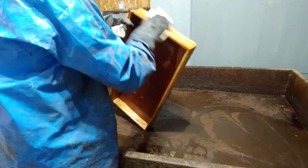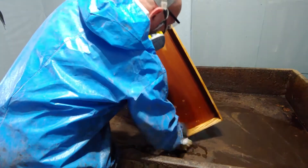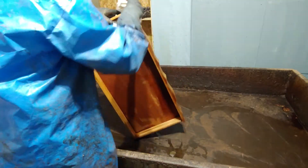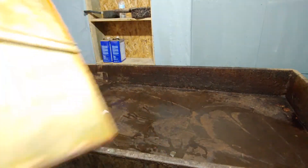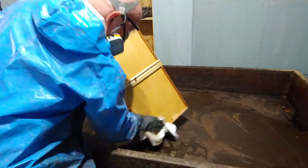I'm cleaning the piece off with a dry absorbent cloth to get all the lacquer thinner off, dry it off real good, and make sure the piece is as clean as it can possibly be. I always feel like the better job I do when stripping and cleaning, the better end product I'll have and the easier my job will be — so it's worth putting a little extra effort into this stage. I'm going to benefit from that for the whole rest of the refinishing project.